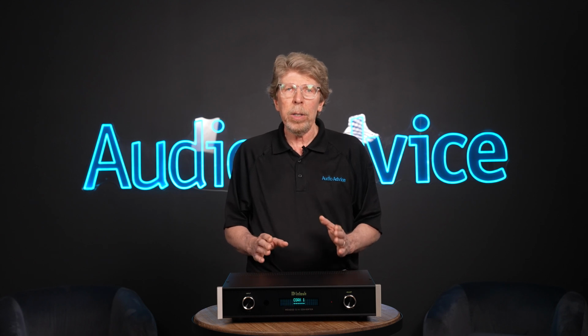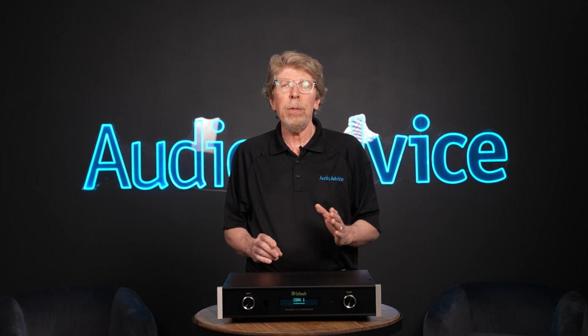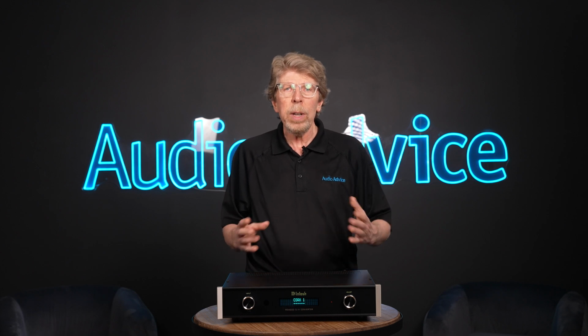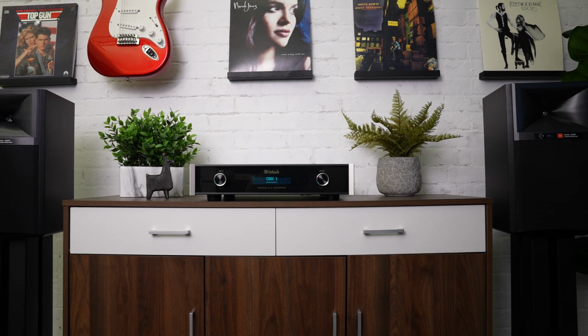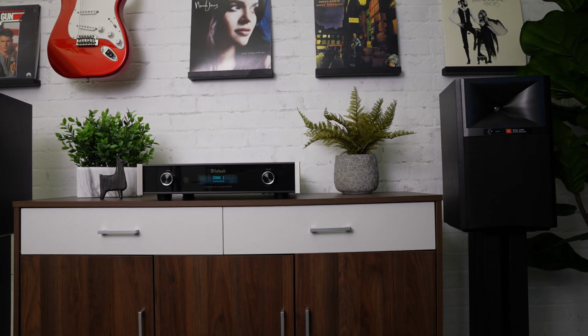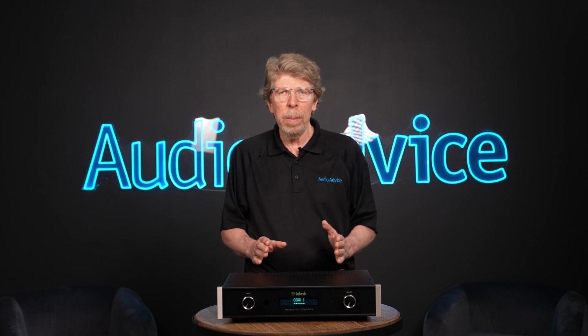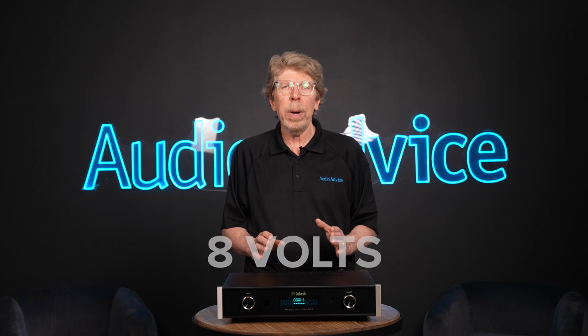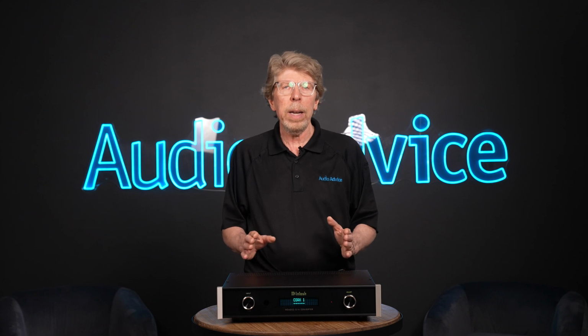However, it can function as a 7-input digital preamp if you go into the menu and change its audio output to be variable. Quite a few DACs on the market have these two options, but a lot of them just do not have the gain to properly drive a power amp. It works, but you lose out on dynamics. McIntosh gave it a very low output impedance, which means it can easily drive long cables should your power amp or amps be located at your speakers. And unlike most DACs that top out at 2 volts RMS output, the MDA200 can put out 8 volts. It should be easily able to drive any power amp even with long cable runs.